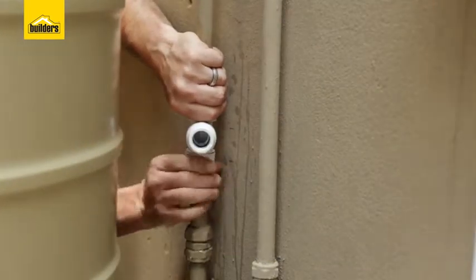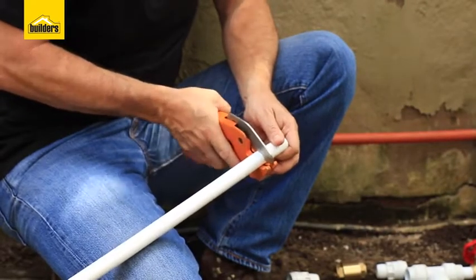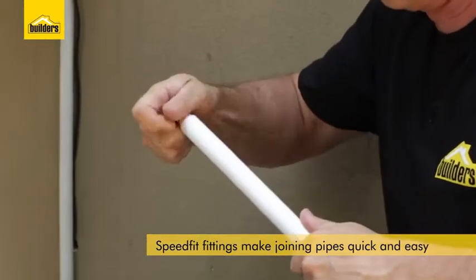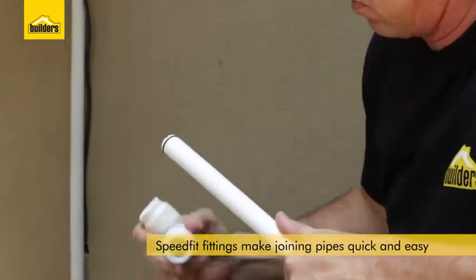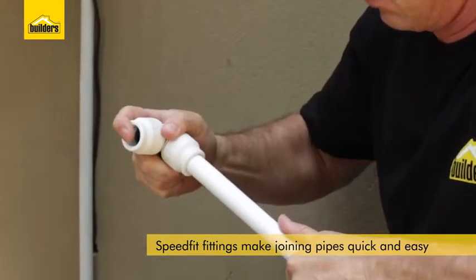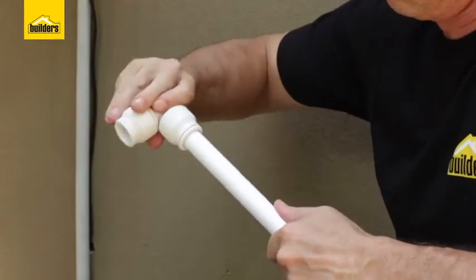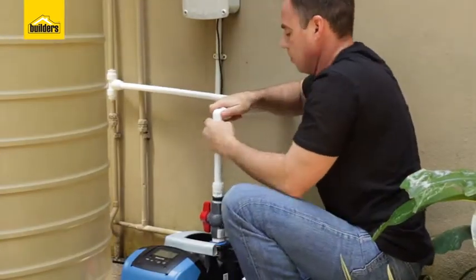As you can see, I've inserted my T-piece. Now I'm going to install the rest of the piping. For the fittings, I'm using SpeedFit pipes simply and purely because it is what it says it is — you're just placing the insert into the pipe and on goes the fitting. Tighten a nut and that's it; that one join is done. It's called SpeedFit for a reason. You can also use brass or copper fittings too.